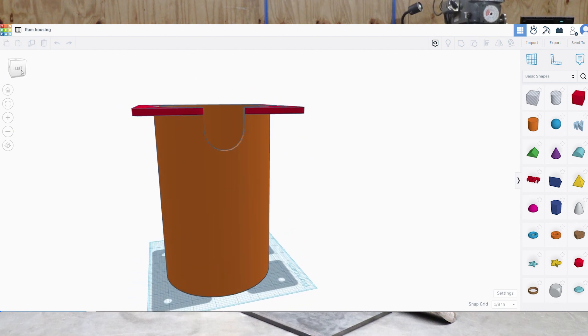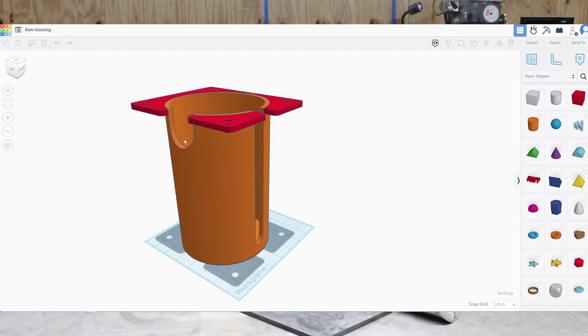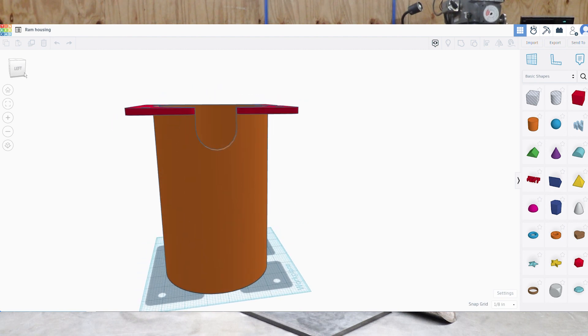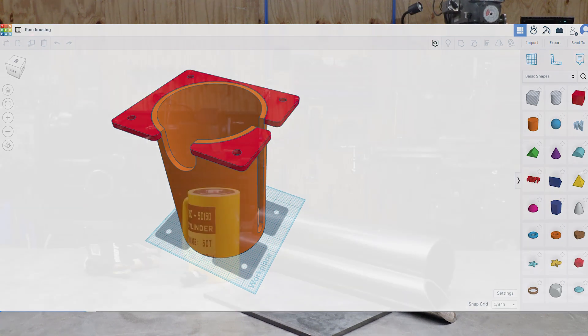The long slot accommodates the handle in the body of the ram and the front slot accommodates the connection. The front slot was made large enough that if a small amount of rotation occurs, that will be stopped by the handle in this slot, but no matter how much rotation occurs, the connector will never impact any area here — so there won't be any rubbing or wearing. That's pretty much the assembled ram body. We've got two of these to make, so let's go ahead and get the plasma machine fired up and start cutting.